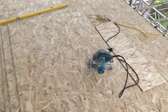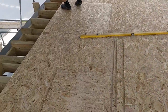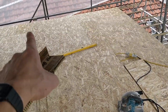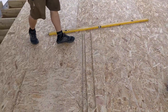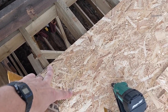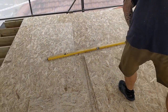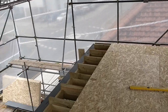We've got these notched out. We've set the saw to a really shallow depth of cut, just 11mm, just kissing the bottom and then snapping them off. Butting them up, staggering the joints as you can see — staggered. Sliding them along and slotting them in, it's going in really quickly. We're just nailing them in about every 200mm the whole way along the board. Very fast work. On top of this we'll go the PIR and then 18mm of OSB.